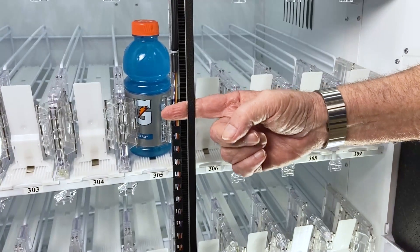There are two common reasons that the cup drops after product is dispensed into it. Number one, the Y belt is too loose. Number two, it could be a bad Y motor — but from experience, the most common cause is a loose Y belt.